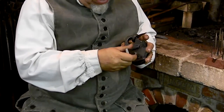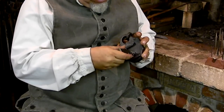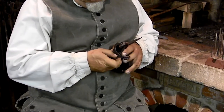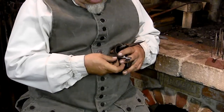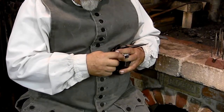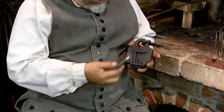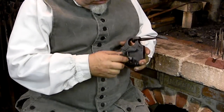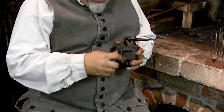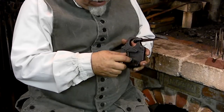Looking at that all the time, a little bit at a time, file away. A little bit at a time, I realized there was a slot in the bit. The front part was raising the spring, and the back part was moving the bolt or keeper out of the way. So, working a little bit at a time — filing, lamp black, back in, trying it again, filing again.